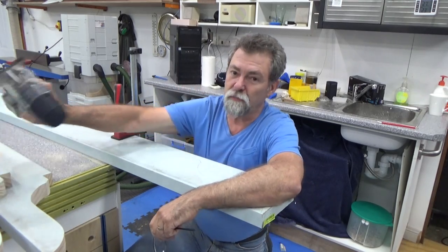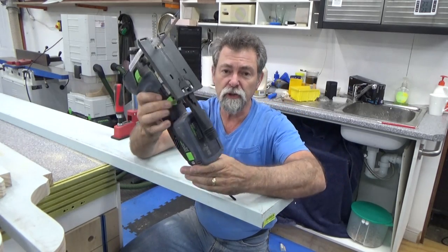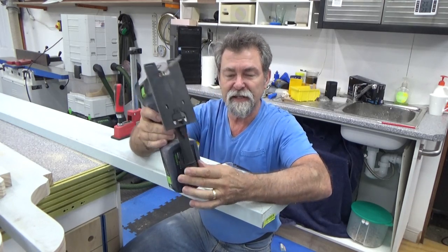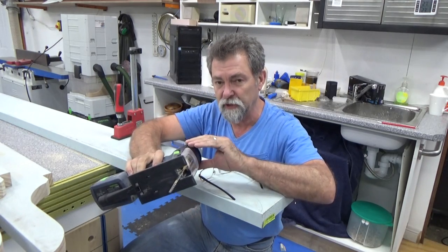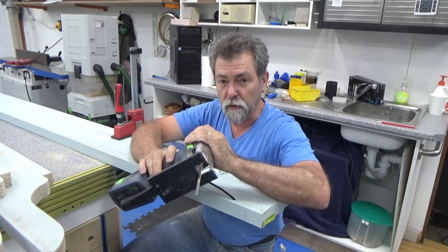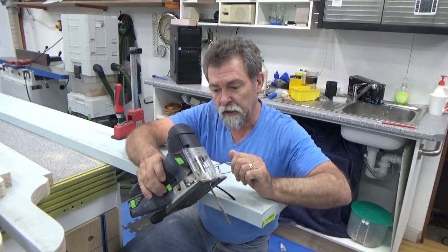What I'm going to do is show you with my jigsaw here, the 420. I do not use dust extraction with this machine. The reason being, it's pulling at the back of the machine and affecting how I guide the saw. I hold onto the saw at the front only to hold it down. I do all of my work here.